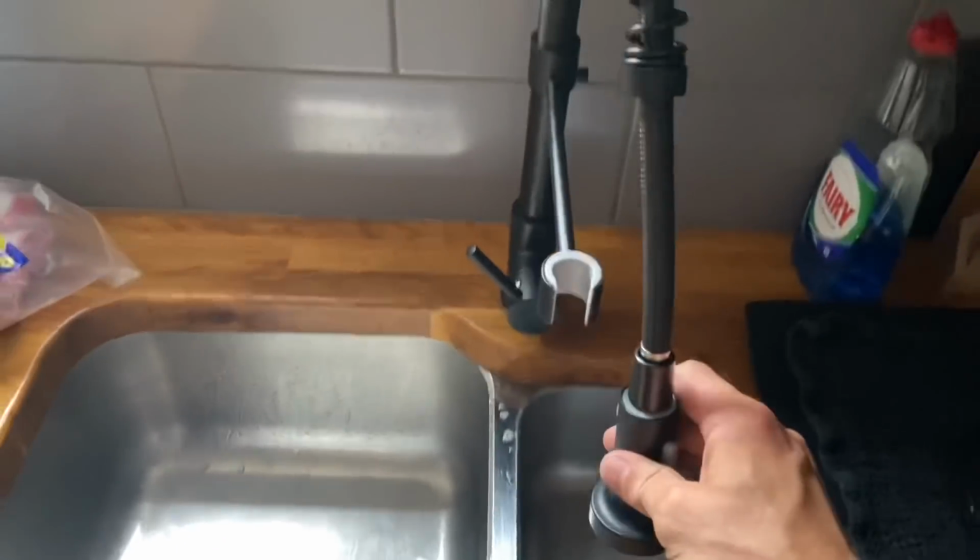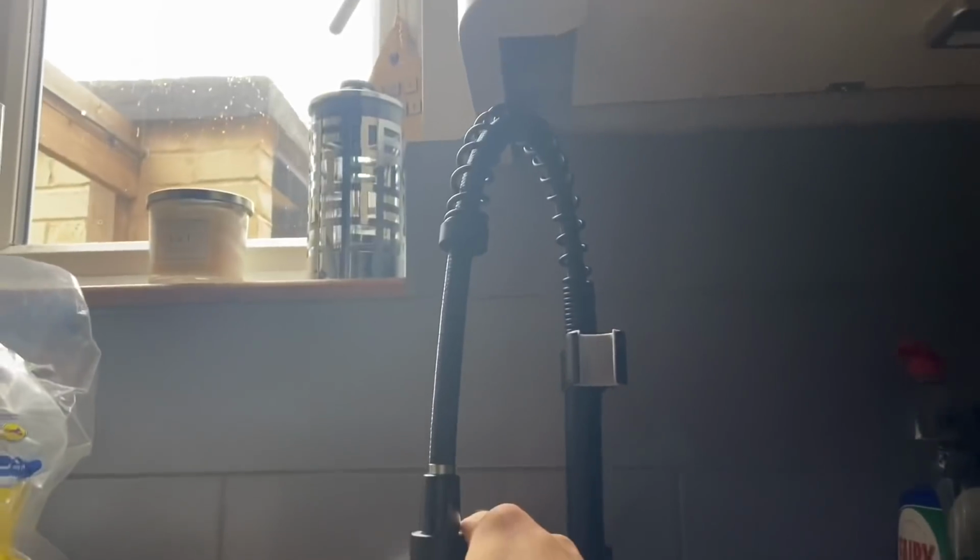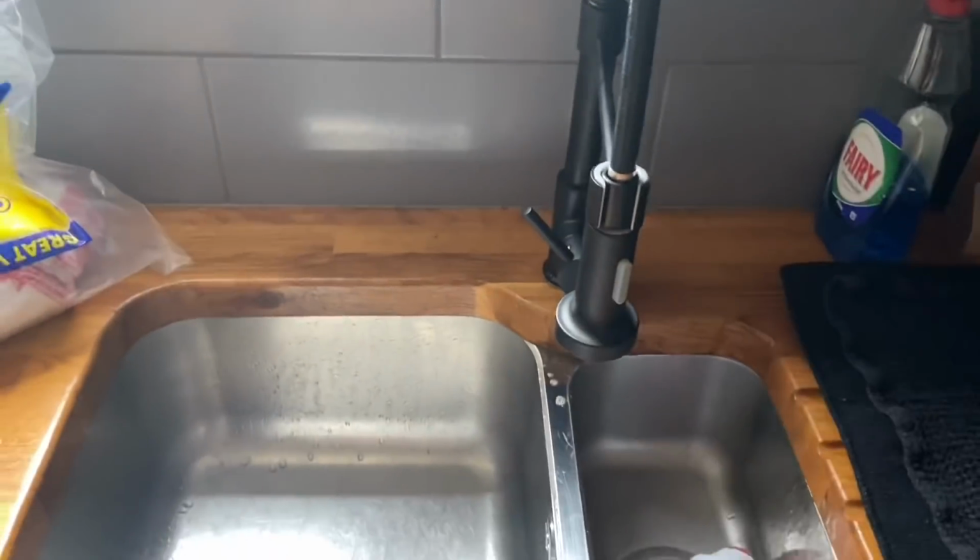And then one really big important thing on taps like this is you cannot have a kitchen sink tap that would go below the spillover level. So the level of the worktop, if that could go underneath it, then that would become a fluid category 5 tap. And you'd need to introduce backflow prevention, which we're going to talk about in a minute.